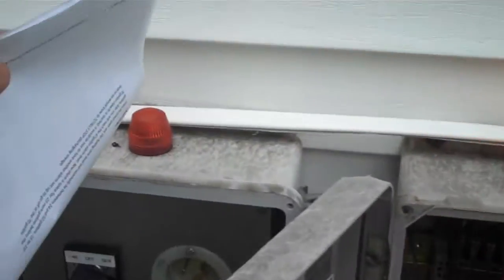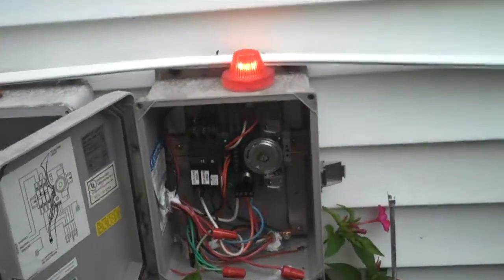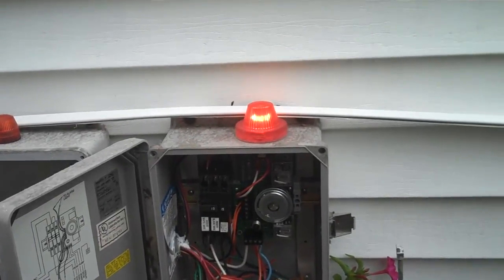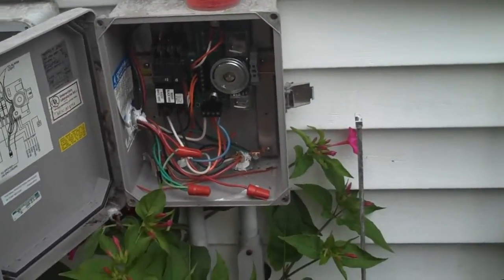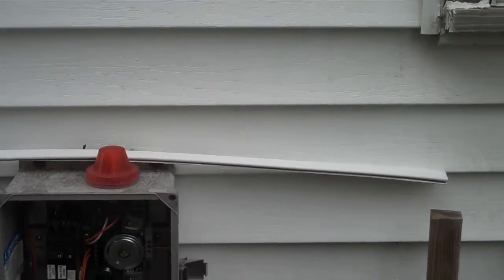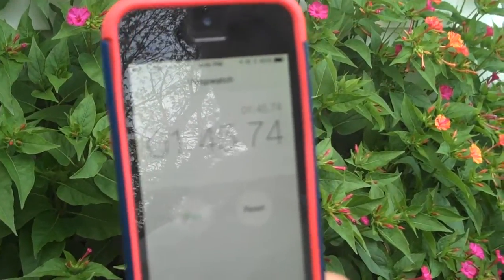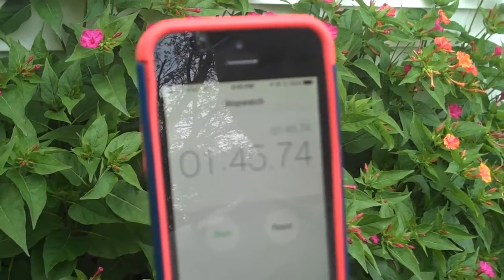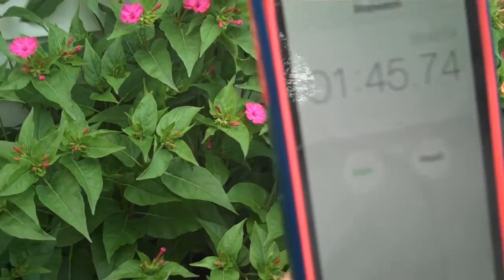The components include the battery backup system — which is currently bypassed — the visible light, and the audible tone. The pump has been running for one minute and forty-five seconds to pump from approximately 47 gallons down to 32 gallons. Steve's got his stopwatch function on his phone, and what we measured here was the pump-down time from the alarm level to the off level for this system. Anything under two minutes is good, so we know you basically have a new or rebuilt pump in there — this verifies that.